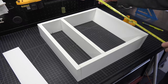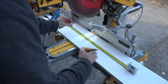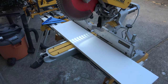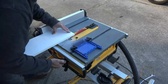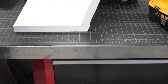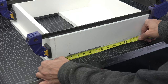I also want to make sure the back space has enough room to allow the beer holder to sit deep without obstruction. The next step is to create the base. I take a measurement from the outside edges — nothing should have changed from the original measurements of sixteen and a half inches, but just to make sure I measure again. The key to this piece is starting the angle of the box upward — I don't want it flat on the front, I want the beveled edge to continue up to the very top. The angle on the table saw should not have changed from the last cut, so just run it through. This is what I meant with the angle starting at the bottom and continuing all the way to the top.